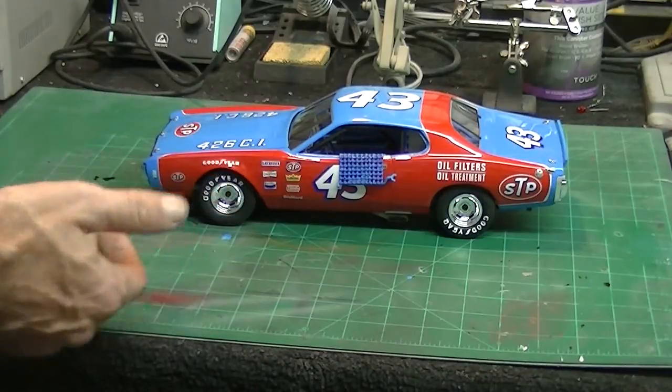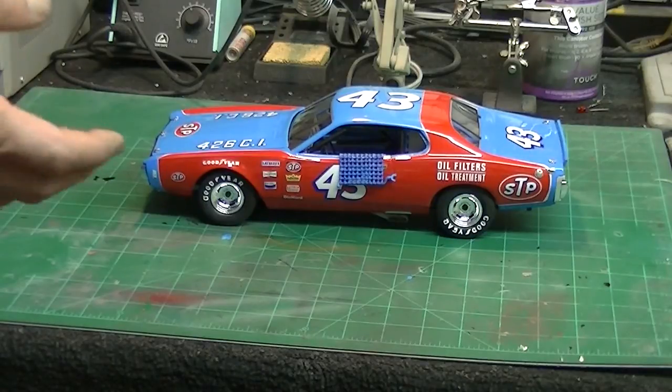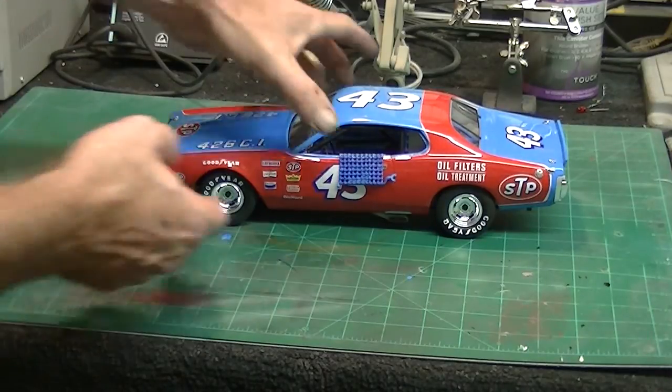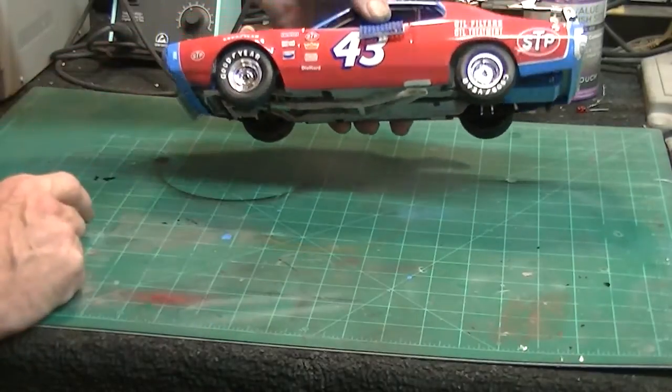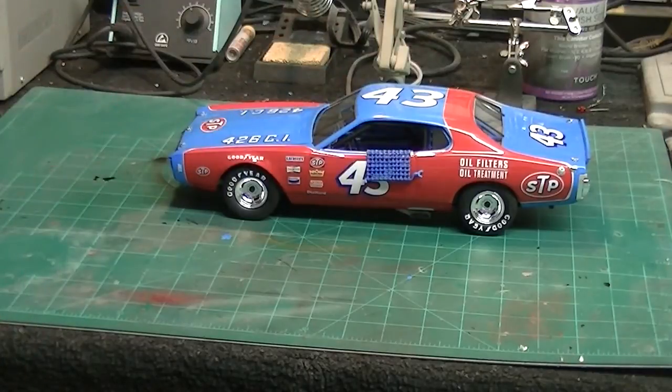So what I wound up doing was just taking a Dremel tool and slicing into them right where the collectors normally would come together on a real header, and just took a grinding tool and ground it down a little bit to a bevel and glued them back together. So it actually looks like a weld joint there, and tilted them back up so they're aligned much closer to the floorboard. As you can see, they're not drooping down. They were tilted way down before, so we straightened that out a little bit.